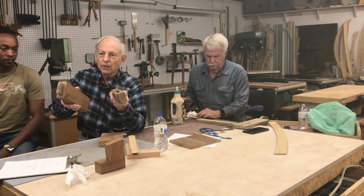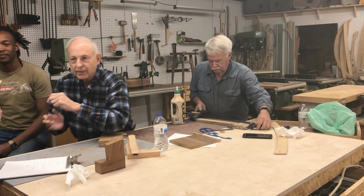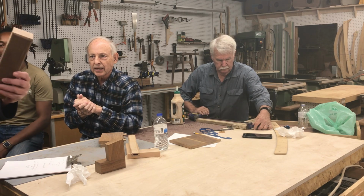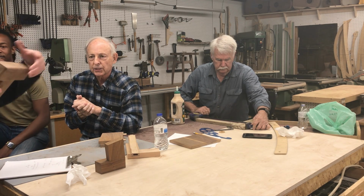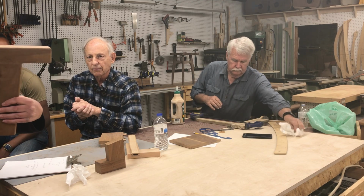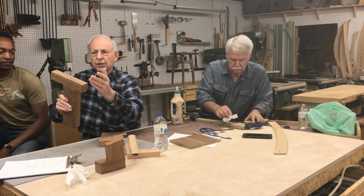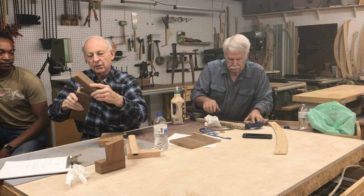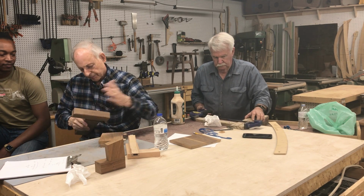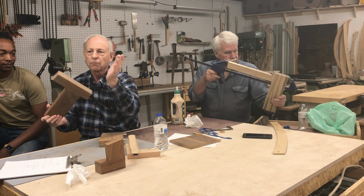Another advantage of a mortise and tenon joint is trying to do something that big. That's like a half inch, a 3/4 inch mortise and tenon joint on an angle. This is 8/4 stock walnut. Really great strength. Easy to glue up. I could take a clamp, put that together, boom, no sweat at all.